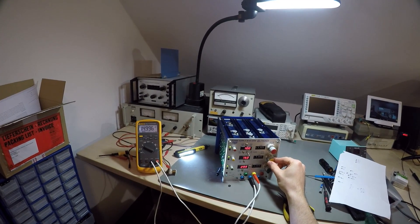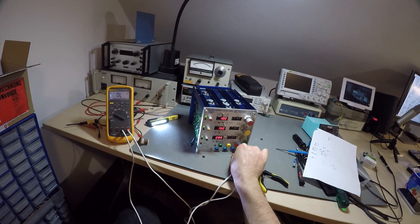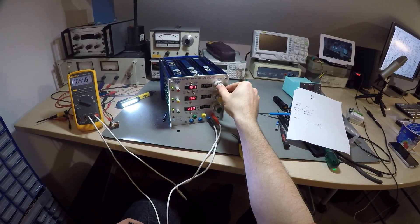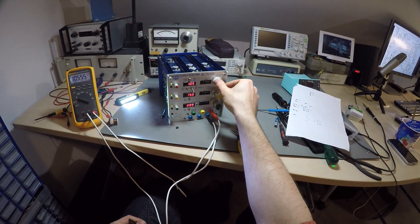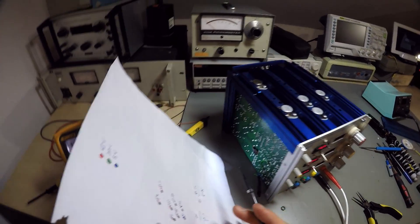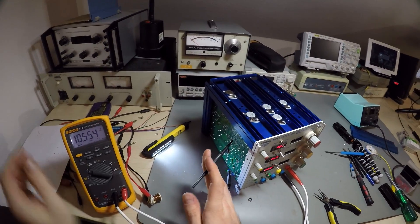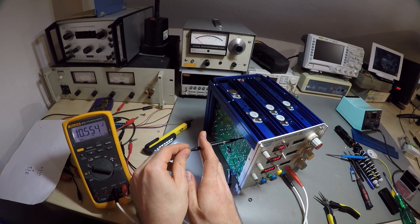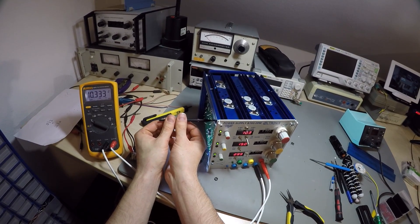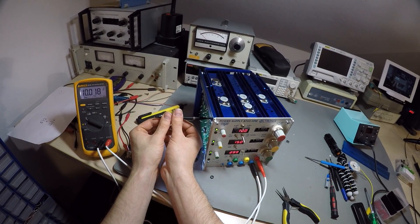Since there's no calibration procedure in the manual, I just have to make that up and figure out the appropriate potentiometers from the schematic. I'll post a link to an augmented photo of the potentiometer holes in the circuit board in the description of this video. As a calibration procedure, I'd suggest to first align the multi-turn potentiometer end stops with the end stops of the mechanical counters, and then, as a second step, set the correct output voltages with the trim pots on the circuit board.